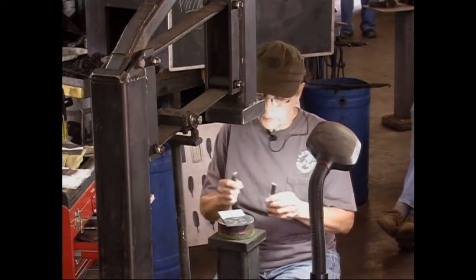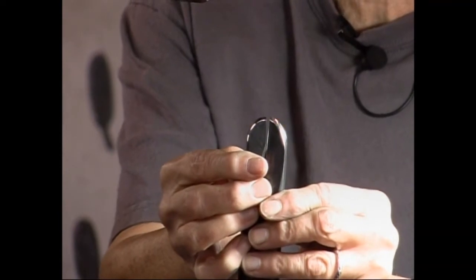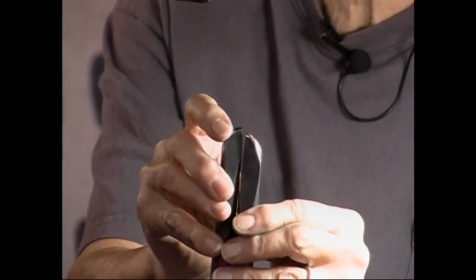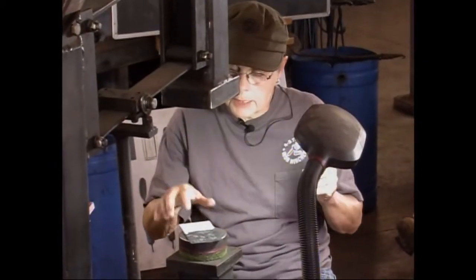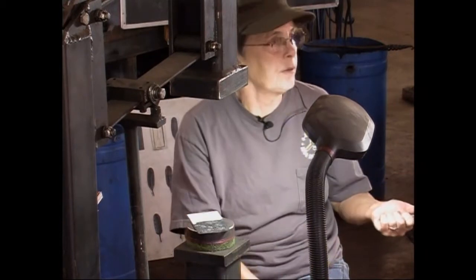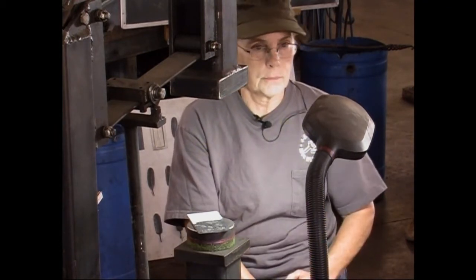Okay, I'm going to use my first pass butcher, which is steeper. And my second pass, you can kind of see the difference between them when I hold them face to face. The first pass will cut in, it will push the metal back slightly. Second pass has a sharp face also that'll flatten the metal some more. That's what you're using as a stump? No, this is what I'm using right now to go around the outside of the feathers that I'm going to make. It doesn't really raise it. It gives the illusion of it being raised, because everything around it is pushed down. A lot of this work is creating an illusion.